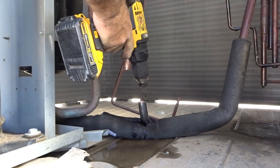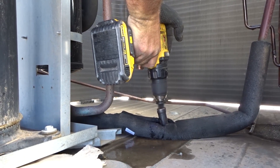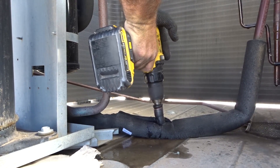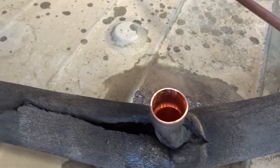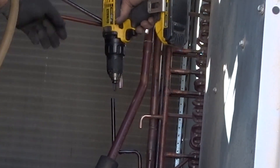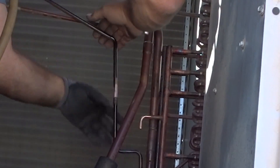You have to make these fittings really tight. You can see it's working out — just going to push down in there. I just made a nice deep bell-end swaged fitting. I'll just have to bend this back up and over — I usually use my flaring block to hold it. This is going to go easy. Just putting in a 3/8-inch swage. There you go.